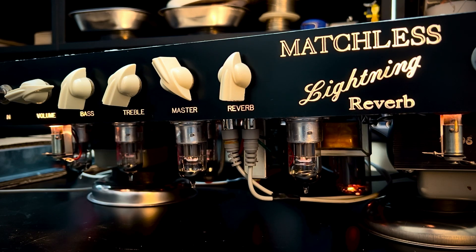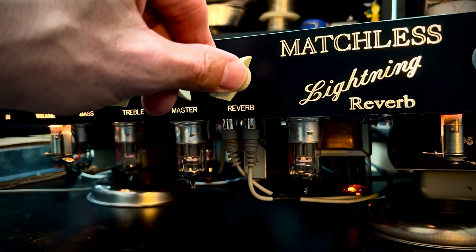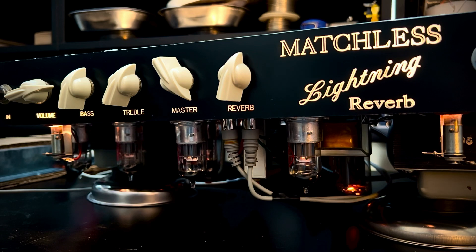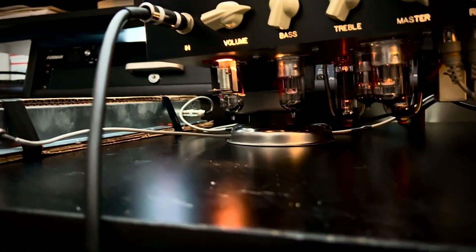So that's where we are noise-wise — it's quite a bit lower than it was prior. But obviously with reverb, when you're turning your control level up, you're literally taking your guitar signal out of the shielded comfort of its chassis and throwing it down a couple of leads into a remote area. While it's out there you're depending on the shielding of the cable to protect it from picking up noise — you're ostensibly dealing with an antenna, right to the grid, right to your phase inverter with this particular amp. Watch this — you hear that noise?